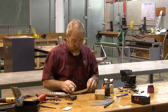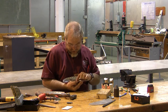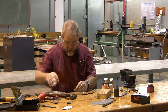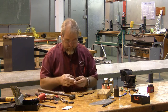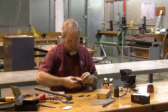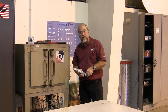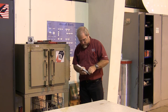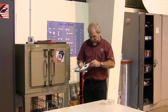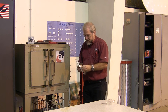Now there's only one thing left to do with this piece in preparation for heat treating — we need to mark it with something that's going to survive heat treating. If I put this piece in with Sharpie on it, the Sharpie is actually going to be removed in the heat treating. So I've got these little stamps, and I'm going to stamp my initials into them — D, M — and those are in there permanently. We're going to heat treat these pieces. I have my heat treat oven here; it's been heating for a while and it's at 930 degrees Fahrenheit. We're going to leave our ribs in it for about a half an hour. Before we put our ribs in, we need to peel the plastic — because if you don't peel the plastic, you will smell burning plastic while your ribs bake. Even Sharpie bakes off the surface at 930 degrees Fahrenheit.